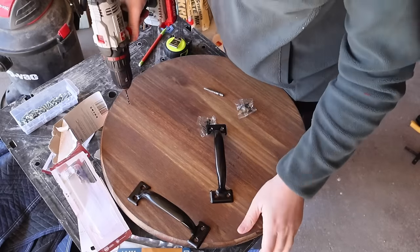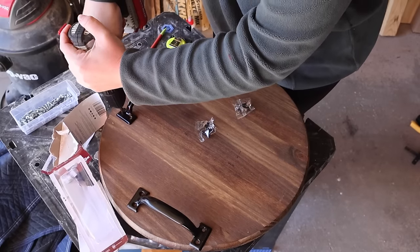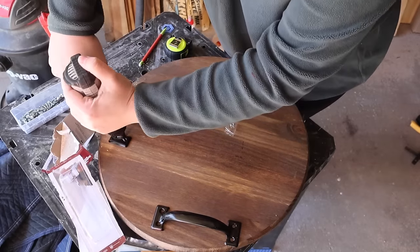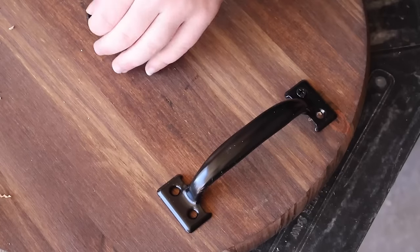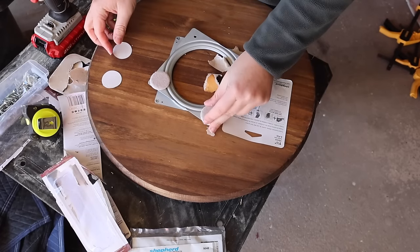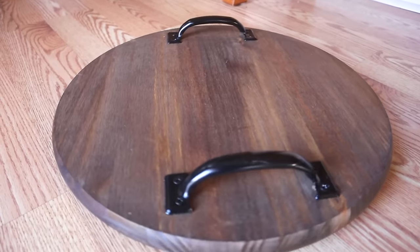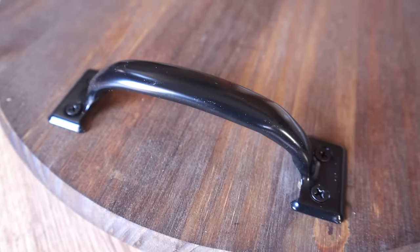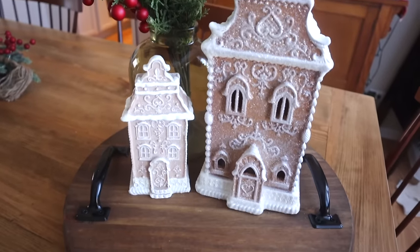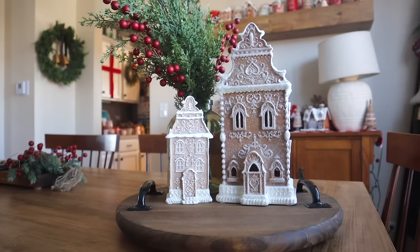I'm using gate pulls, but you could use any cabinet hardware — I like that you can screw these right into the wood without putting holes in the bottom. I like to drill pilot holes and go in about 75%, which gives me wiggle room to get everything centered, then do the last 25% on all of them. Add felt pads and a sealant if you plan to put a lot on top, especially if you painted or stenciled it. This would make a great gift — you could monogram it with a stencil, paint it, or do a sports team's logo. Huge thank you to Courtney, and I hope I did you proud.